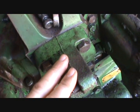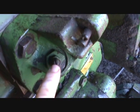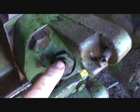I replaced that fitting off the old one and put it on there. I've got the lift arms on. I did not replace the packing because I haven't got it yet, but I can always just pull these four bolts off. Now — if your pull arms or three-point drops too fast, what you do is loosen up this small nut here, put a screwdriver on that, and turn it inward and that will slow down the drop rate of your lift arms. If you've got an implement that just falls like a box of rocks, you've got to adjust that. Just a friendly tip there.